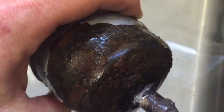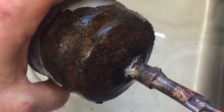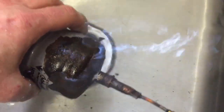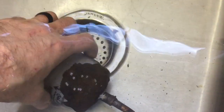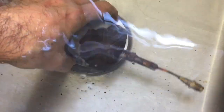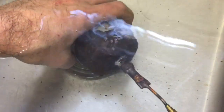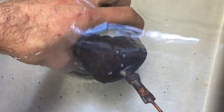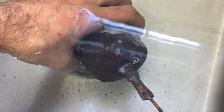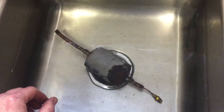I could not get this thing to bubble and my leak detector barely went off. I had about 250 psi nitrogen and then just whatever remaining refrigerant was in the system — it did have about 40 psi upon arrival — but I could not get it to bubble with soap. Just a quick little update, tech tip maybe. Sporlan, if you see this — we'll see you.